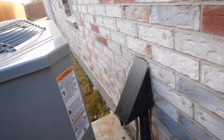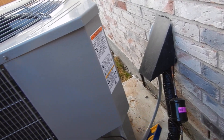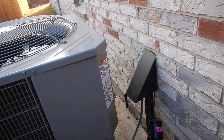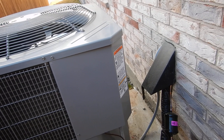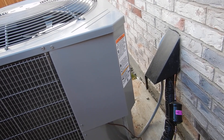So we learned that the gas has not been adjusted, the drain line discharges too close to the ground, and we do not have an air gap for this drain line inside the garage. Also, the water heater does not have a safety pan — safety pans are not required on tankless water heaters, but they are required on water heater tanks.